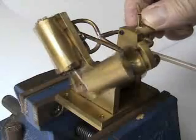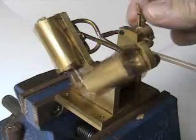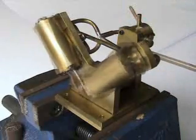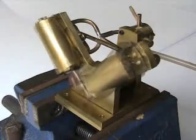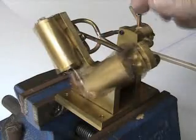Because of the two cylinders at 90 degrees to each other, one of the ports is always open and therefore it doesn't need a twist of the crankshaft as many single-cylinder oscillating engines need in order to start.